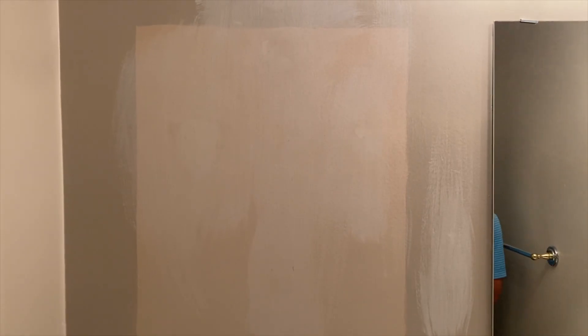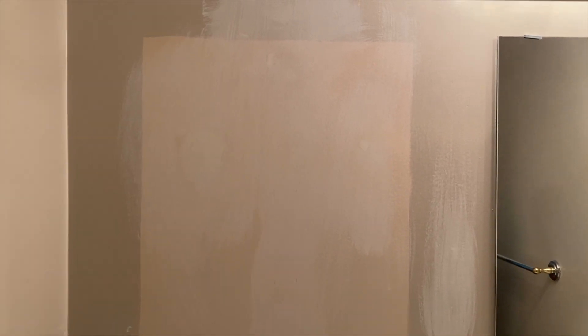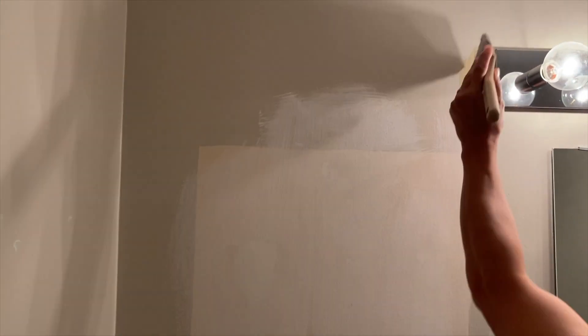Now that the primer has dried and the wall is nice and smooth — you can see it, you can feel it — there are no more bumps and we're going to start painting and show you the finished product. It's been 24 hours and the paint has now dried. You can see behind me the wall is smooth, all the holes are covered and the pen marks are gone. It's now ready for you to do whatever you want with it. This process did take some time but not much — in total it was about one hour of actual labor. It was very easy and anyone can do it. Thank you for watching.